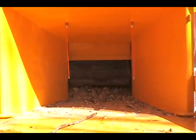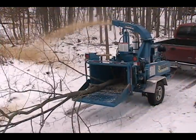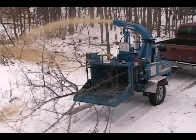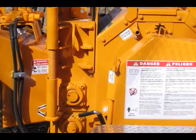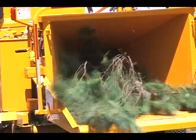The large 13-inch by 17-inch chipper opening, along with a 45-inch wide infeed hopper and 30-inch fold-down infeed tray, allows the 990XP to easily process limby material with multiple stems. The feed system is close coupled to the chipping drum, with the top feed wheel placed within 1.5 inches of the drum at its closest point. There is little area for material to hang up in the infeed chute, making it perfect for chipping fibrous materials.